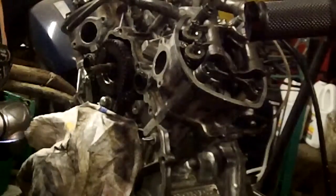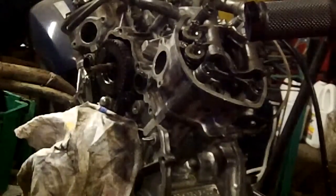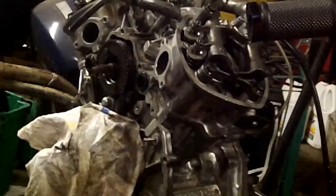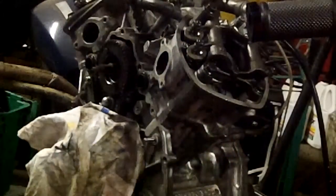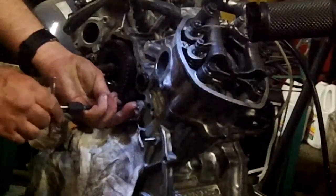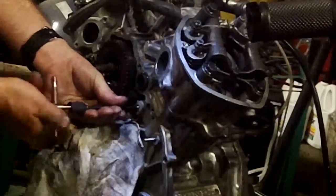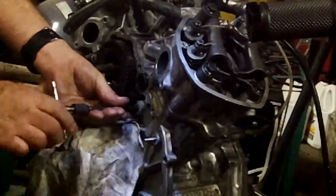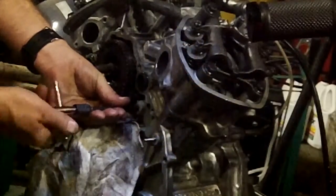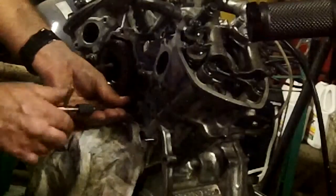I'm using a one centimeter insert. I apologize — I didn't have my helicoil insert kit on the end of my thread tap because I'm brain dead. So basically I'm just going to tap the coil into the hole. It bottomed out — that was a deeper hole than I thought, but anyway.